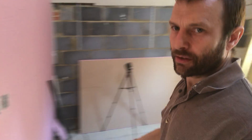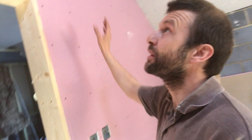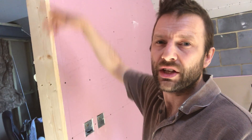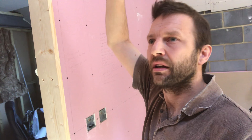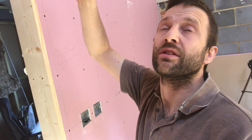With the lighting as well, because there's so much Celotex in the ceiling, I'm going to come from the consumer unit and feed the switches. So I've got a switch here. The reason I'm feeding the switches is because I don't want to go anywhere near the ceiling, anywhere near the roof. What's the point of running all that extra cabling up there, trying to stay away from Celotex, trying to stay away from insulation, only to come back down again?